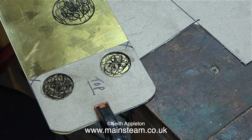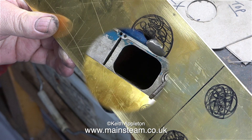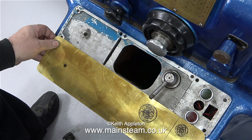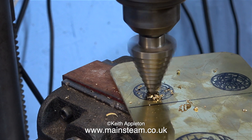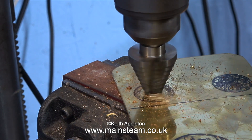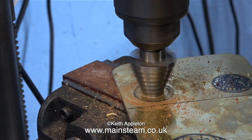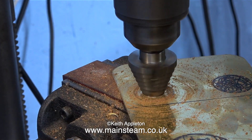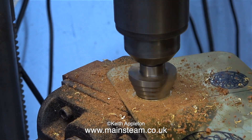As you can see, I didn't cut the brass plate to the same shape as the cardboard. This is a bit of mad marking out, but I don't want to drill the holes in the wrong place. When I hold the plate next to the control panel before drilling, you can see what I'm doing. Now it's over to the drilling machine. I fitted one of these hole cutters into the chuck. Some engineer viewers may wonder why I didn't mark all the hole center positions on the brass plate — you don't really need to with these hole cutters, because you can see where it's going, and if it starts to be in the wrong place you can apply side pressure to steer it in a different direction.